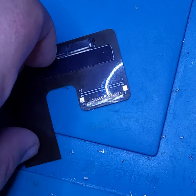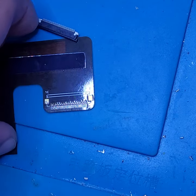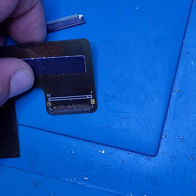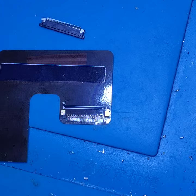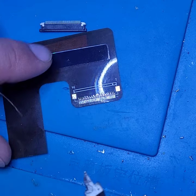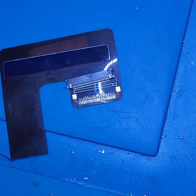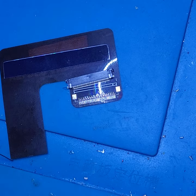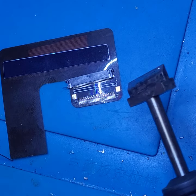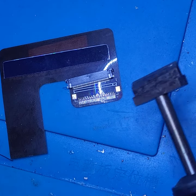As you can see, we've pretty much covered all the pins with solder — it makes the reflow much easier. Don't be afraid to add a little more. We want a little bit because all we're going to do is just place this on top and heat up the pins. Because this tip has such a wide surface area, I can cover the entire set of pins in one go.